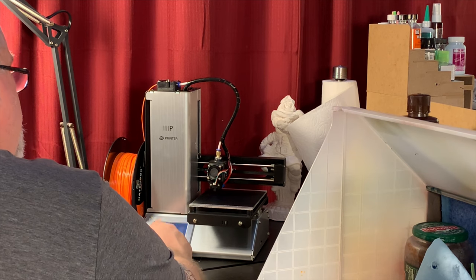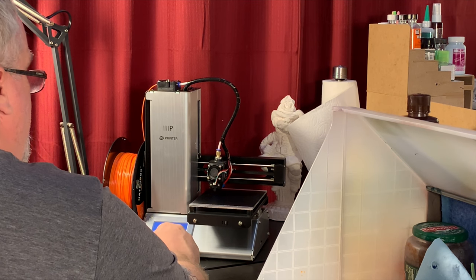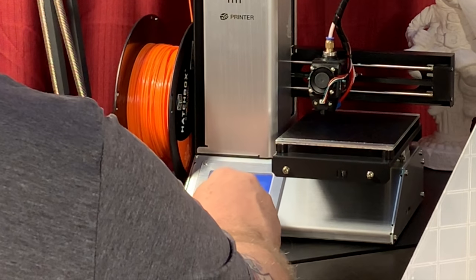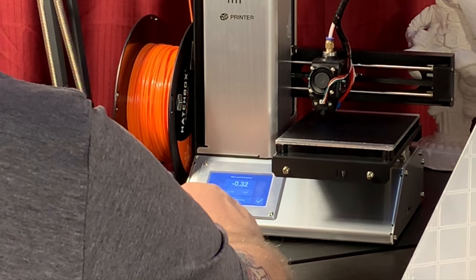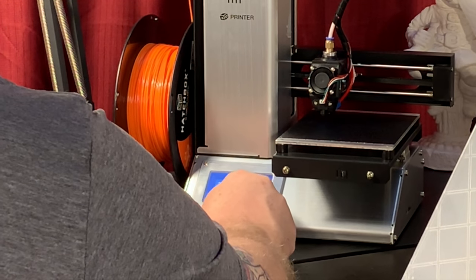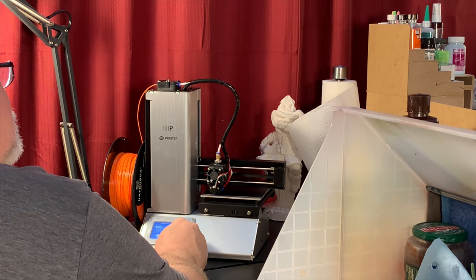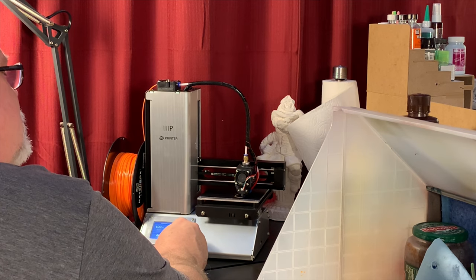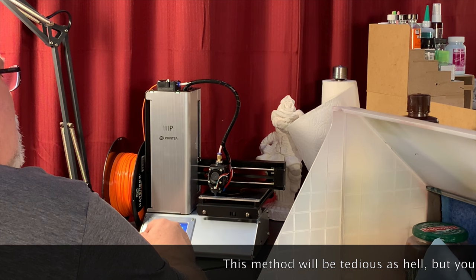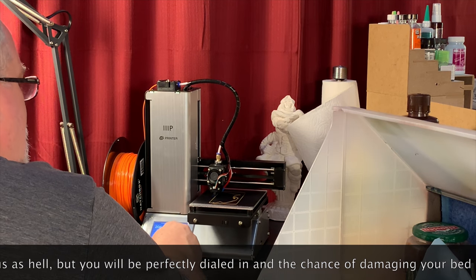I'm going to go back and preheat, make sure the nozzle is staying hot. Now I'm going to go to move and tune — clearly minus 0.30 is not good enough. I need to come closer, so I'll go 3. I'll accept that and go back and try to print again. I can see it's just kind of dragging around, not really sticking good. I want to give it a fair shot, so I can see what I have. And now we can cancel.